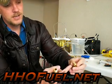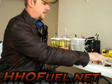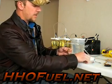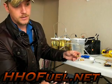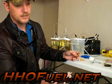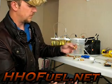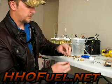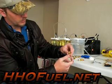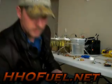The reducer fitting connects on a 7/16th nut. You'll need an M6 size tap to go ahead and tap this out right here. This is a tip from a MIG welder — it's a slow wire feed tip and it's a point-oh-four-zero. So go ahead and use your tap, tap this out, and it will screw right in there.